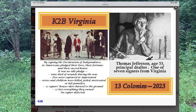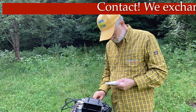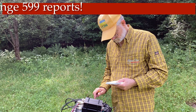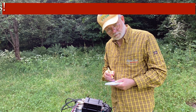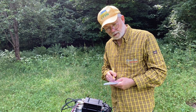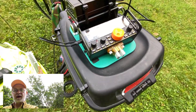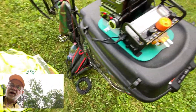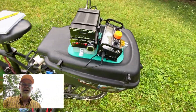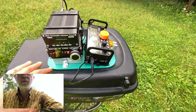No problem making contacts with local stations a few hundred kilometers around me. It's very versatile in configuration possibilities. On 20 meters there's basically no need to tune — the half-wave is resonant pretty nicely. My idea was to have the whole station very portable and modular, so I installed my transceiver, tuner, and power amplifier combo onto one chopping board.